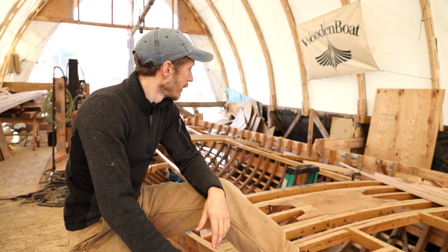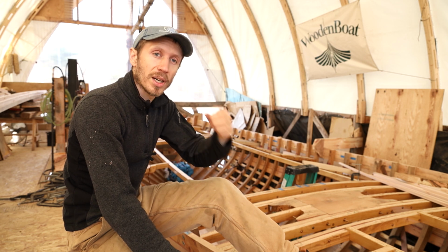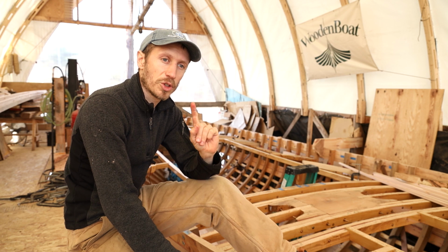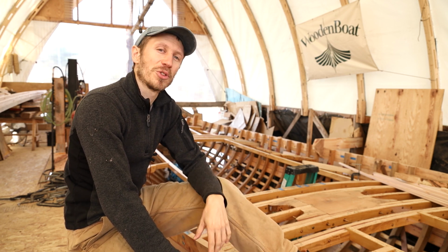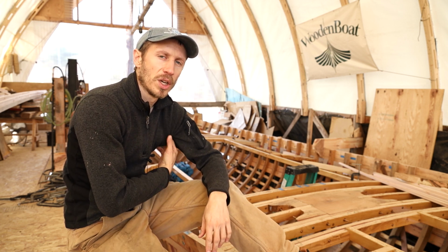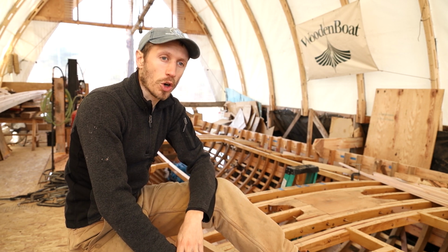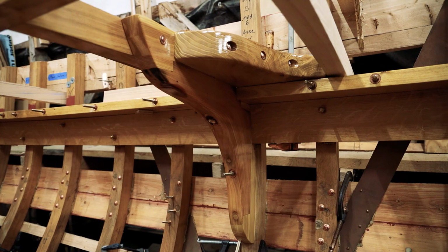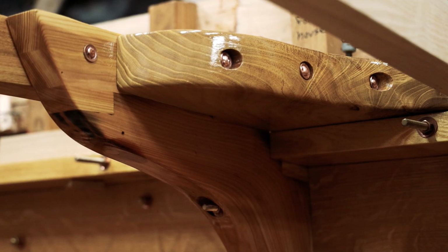I'm fine. The other thing is making the copper rivets. We made the hole a little bit larger than our 1/4 inch rivets. So just so everybody knows, a 64th larger is not enough for them to drive that far in. They started bending over on me, so I needed to drive them back out and figure out a bigger opening for them. And once they went in, that was perfectly fine. So Anne helped me to back those and I peened those over. So those look great and I'm so excited.